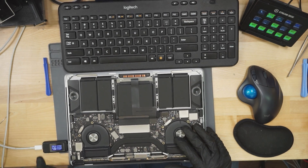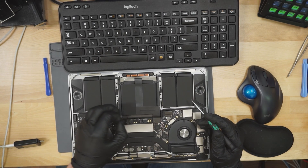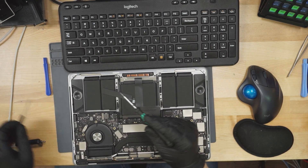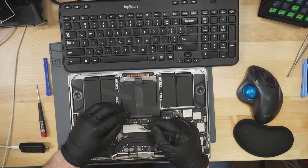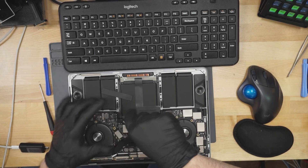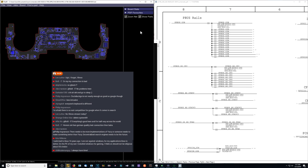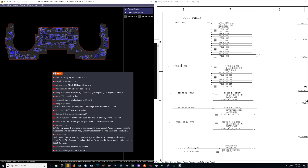This thing is taking zero amps. Zero is an interesting number — that is most likely indicative of some sort of short circuit. So let's see what's going on. We're going to unplug the board, unplug the battery, unplug everything from it, and see what's wrong with our little touch bar Mac. We have PPBus G3Hot as my first rail, so let's measure that rail and see if it's present on this MacBook.